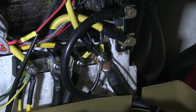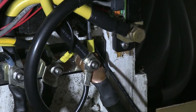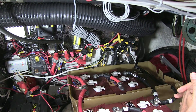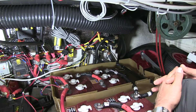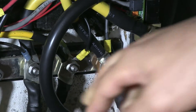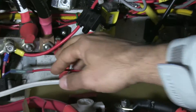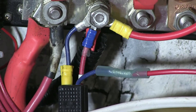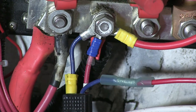That's actually the negative for the windlass — pretty important, because windlasses or any type of motors, starters, thrusters, all those devices don't die because they're badly manufactured. They'll generally die for one simple reason: low voltage. Lack of voltage is what commonly causes those devices to fail. Also, take the time to make sure that the terminals are properly stacked. I'm also noticing some of the wiring has non-heat-shrink terminals, and some have heat shrink terminals where no heat was actually applied. So the heat shrink terminal is there, but the connection is not sealed — it's acting as a butt connector without being sealed. That would be something to rectify.